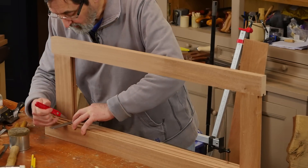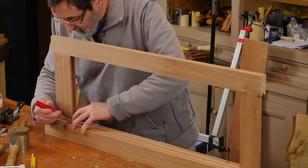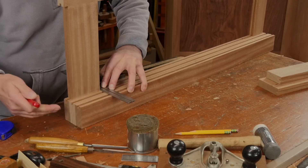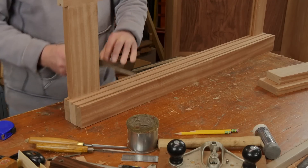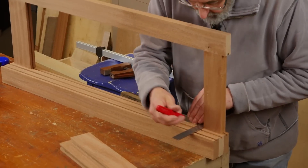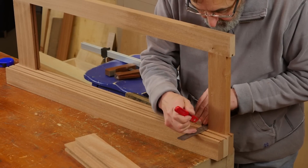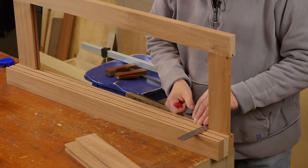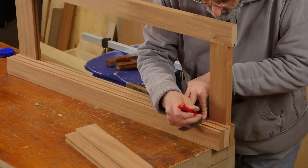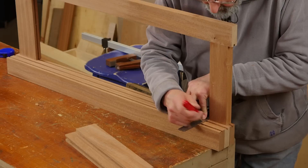I'm going to work to this existing door because I want the two doors to be exactly the same size. I'm going to start with the inside of the rail here and make a mark across the two rails. I flush this end up, get it tight on the inside corner, and go across this inside face. I do the same with the stiles, going across the two where they meet on those inside faces - just a small knife mark across the two as a registration line.